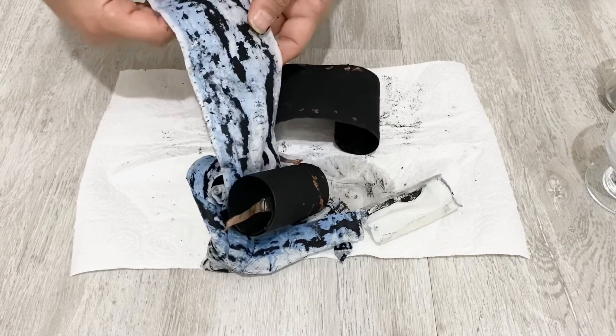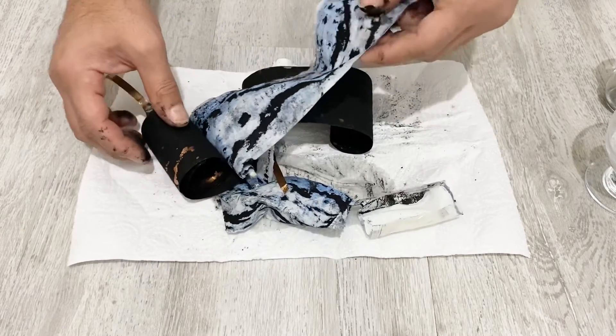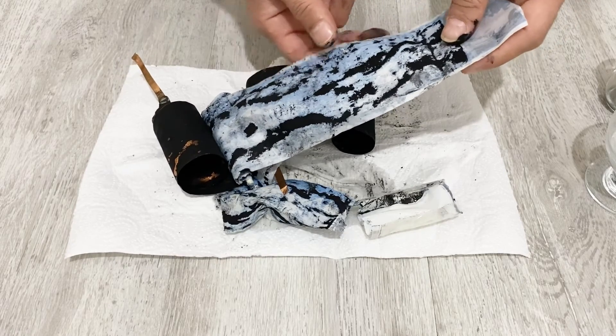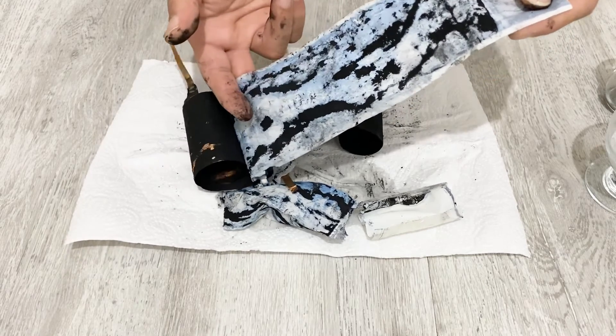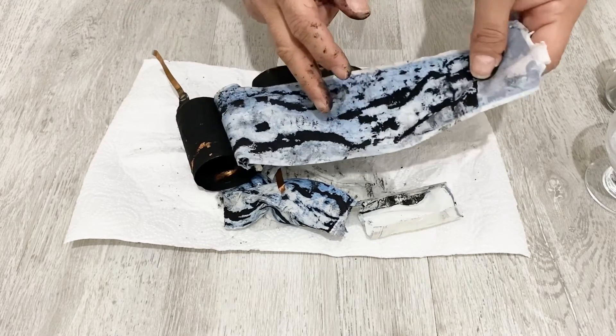As a separator, you can use two pieces of regular paper. If you have money and can find special separator materials, you can use those. But if you don't have access to special materials, regular paper or photocopy machine paper will work for this supercapacitor. I've used photocopy machine paper in this one, as you can see.